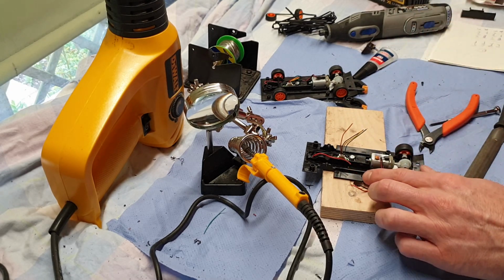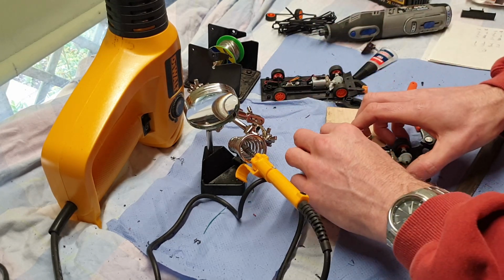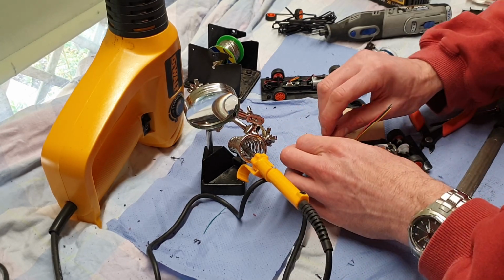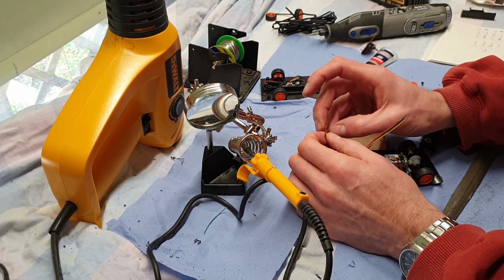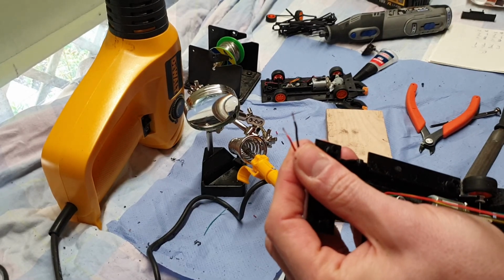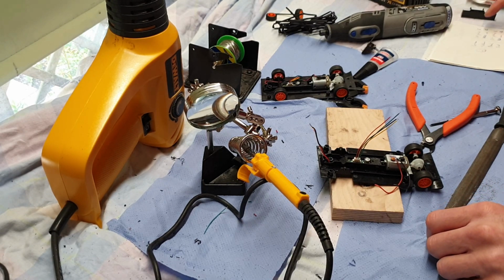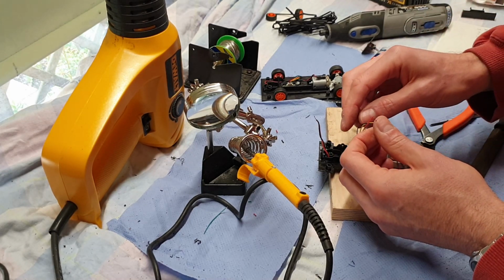These wires are so thin, it's unbelievable. And then simply trim. Like I said, the insulation is so wafer thin, you don't even need wire strippers for this. You can just use your fingernails. So just strip the wire back about 5mm on the end. There we go. And this one, can you see that? They're nicely trimmed. So the wires we're taking now are the green and the black. Let's take those out from the wire harness.